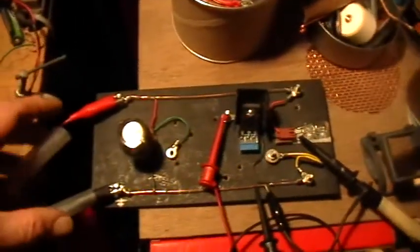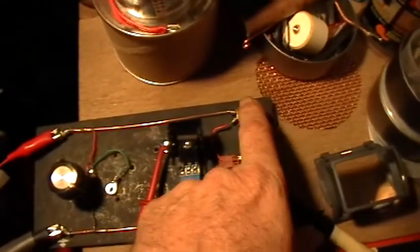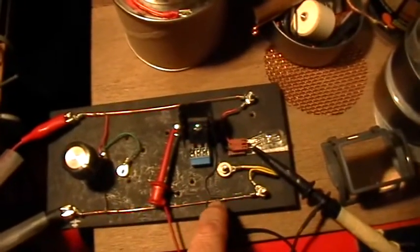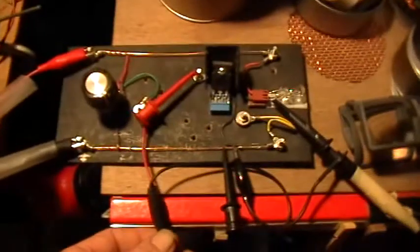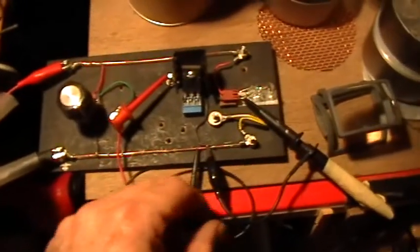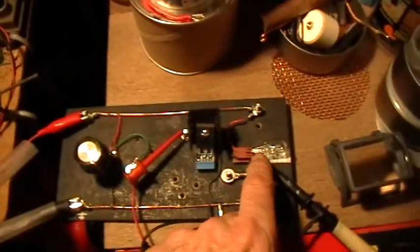They are not in this demonstration. What I'm going to be doing is using the MOSFET to turn on a load that's between the MOSFET's positive rail, load, drain, source, negative rail. The gate of the MOSFET comes back over here to this terminal and I've got the red output lead of my function generator connected to the gate of the MOSFET. This down here is the negative rail, so there's the black output of the function generator and the scope probe's negative lead there.